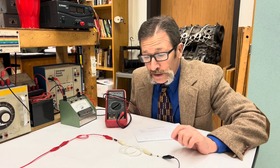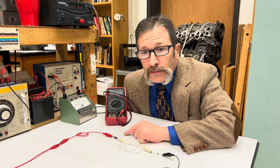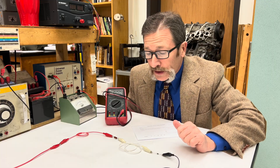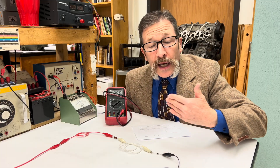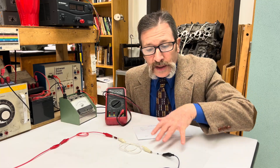Let's go over some typical student responses. First, students will say this is a trick — you didn't tell us the size of the resistor, and without the size of the resistor, if you have something in series, it's going to be impossible to know what that voltage drop is. The second more typical response is: well, if I have three volts, I must have three volts here and three volts here.